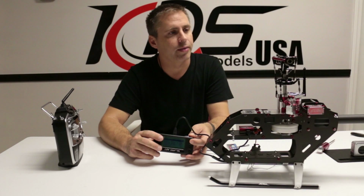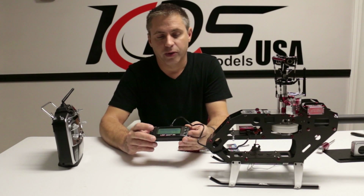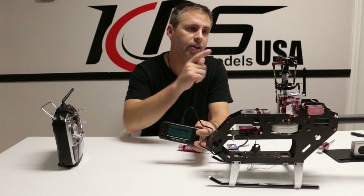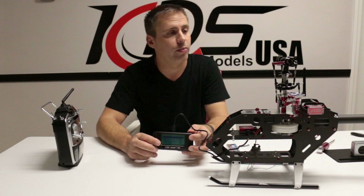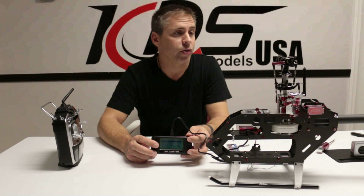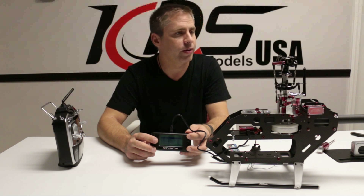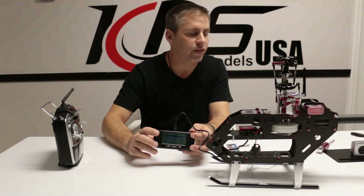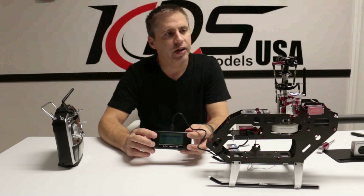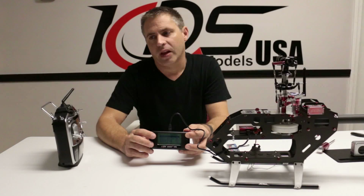I've checked this helicopter already. I have 12.5 on the top, and I'm going to move it back down to 0, then move my stick, toggle up again, and it's going to give me negative, and I also have 12.5 here. If you do not, you may need to move your swash plate up or down a little bit. You may need to make a few adjustments in your linkages. What I normally consider close is if I get 12.5 up and I have 13.5 down. That's pretty close.